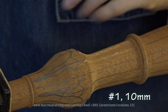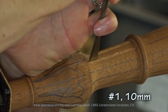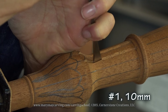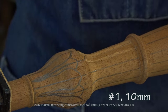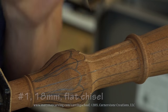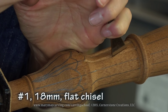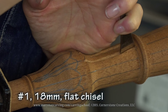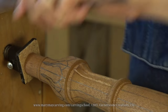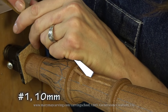This is really just to make sure that the inside corner is nice and straight and clean. I'm going to use a larger flat chisel — the larger you can use for these long surfaces or long lengths, the better. It's going to keep it straighter.